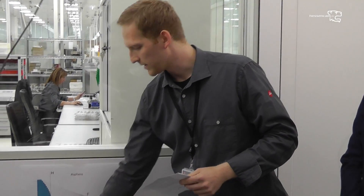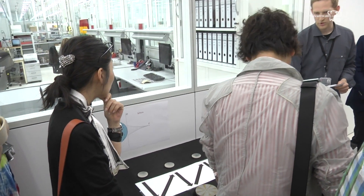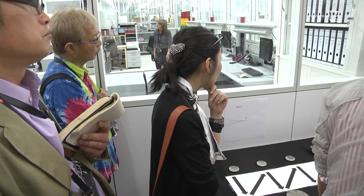You can see the whole production line to finish the aspherical side. When the aspherical side is finished, we take the lens off the mandrel again and finish the spherical side again with a polishing tool. Then you have the finished lens, which goes to the next production step.